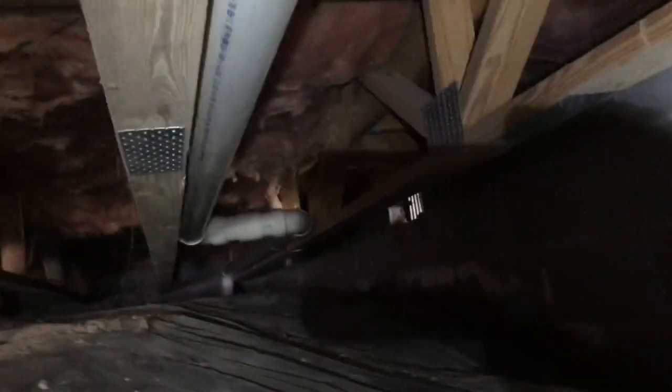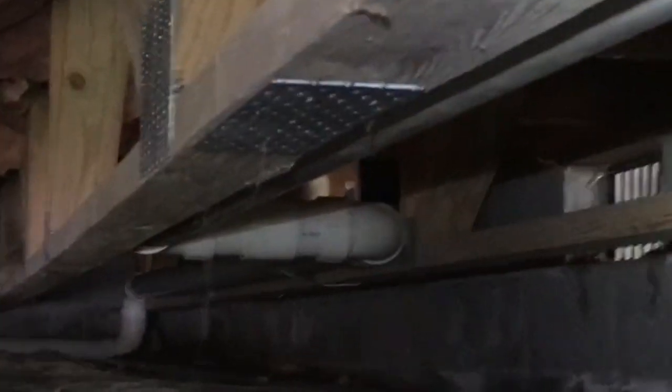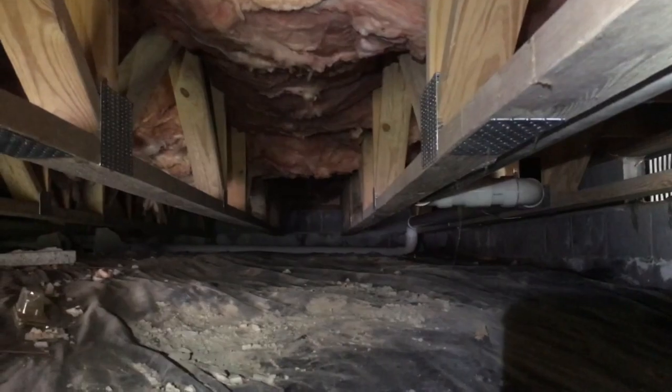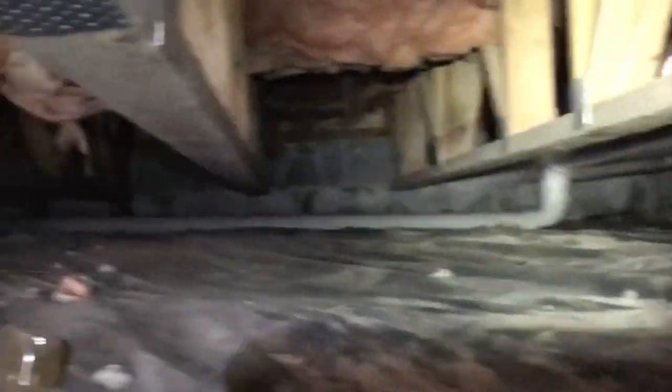There's a crawl space and he used three-inch pipe — we like to use four-inch. He's got some 90-degree fittings, and as you know if you watch my videos, we prefer 45s because they save us on airflow. 90s cut off airflow quite a bit.